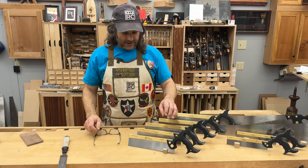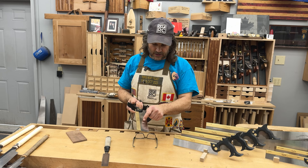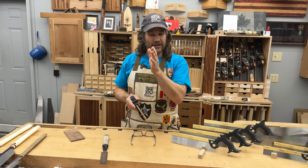Western saws have a heavy brass back, designed to keep that blade nice and stiff when going through the wood and not allow it to wander. They tend to be short — this is a dovetail saw, never used on wood much deeper than an inch, so you don't need a lot of distance. By keeping the blade narrow, that heavy brass back keeps the relatively thin blade nice and straight. The straighter the blade, the straighter the cut, the flatter the surface, and the more likely you are to be able to join right from the saw.